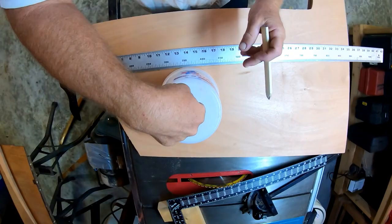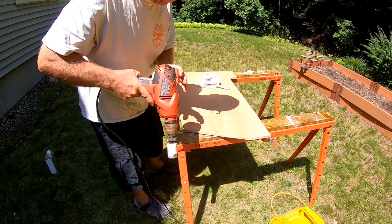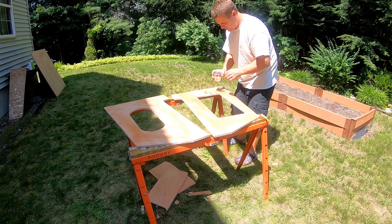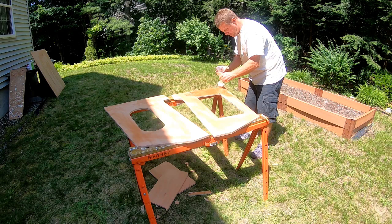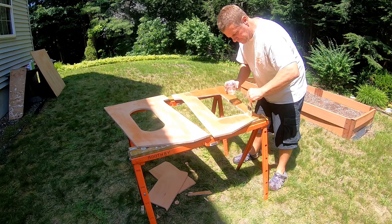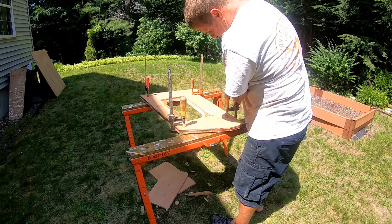We have our side pieces — all four of them — cut out. The next job is to cut out the port lights, or the windows, so that we can see out while inside the dodger — a very important feature. The reason for laminating two sheets of plywood together becomes clearer at this point: the nice oval port light on the left side will be on the outside sheet, while the inside sheet has a larger rectangular cutout. The idea is that pre-cut rectangular pieces of plexiglass will just fit in from the inside, so from the outside you'll just see the nice oval port light. You could bolt the plexiglass on the outside of the dodger, but that wouldn't be very aesthetically pleasing.